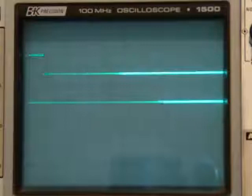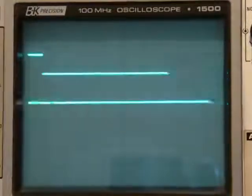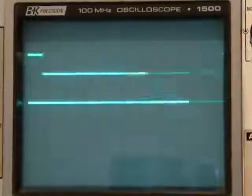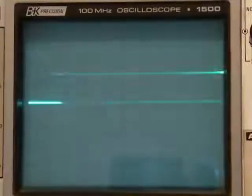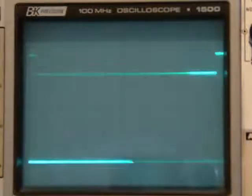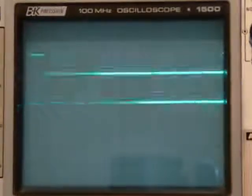The motor driven positioning uses the signal on the top, which is called the pulse. The signal on the bottom is another signal on the wire, in case you have something controlled through the cable. This is vertical — notice that the pulse is wide. And this is horizontal — the pulse is narrower. The bottom trace is the VH signal, so right now it's in horizontal, and now it's in the vertical position.